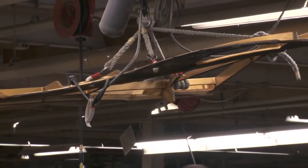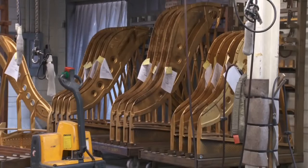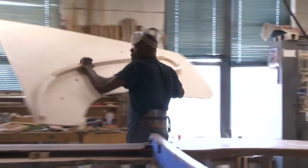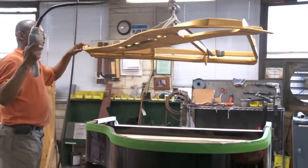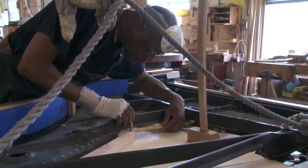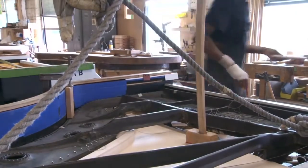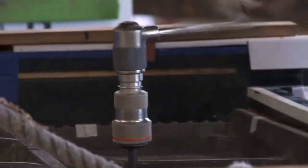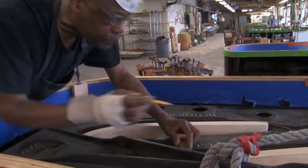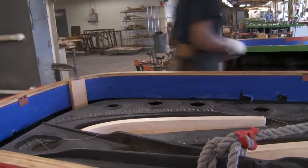One important component is the iron plate, cast from bell quality iron in one piece from our exclusive patents. The soundboard, with its bridge and the cast iron frame, are now assembled inside the piano rim, or the belly of the piano, by a man called the belly man. It is an involved process to get the soundboard correctly placed and the bridge height precisely determined, so that the pure Swedish steel strings we use will have the correct downward pressure or bearing on the bridge all across the scale.